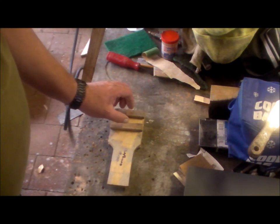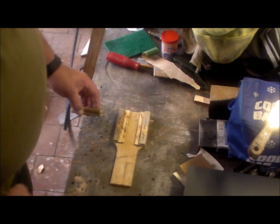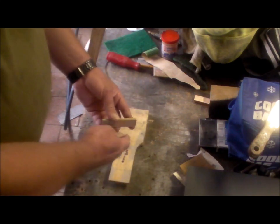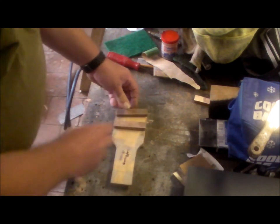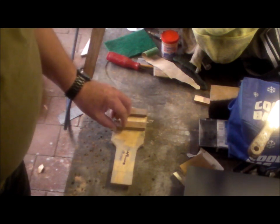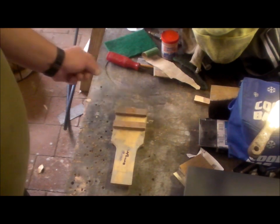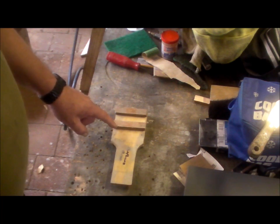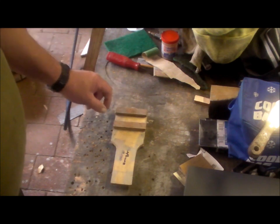These two are the cope side, so that gets laid up in the drag, clipped over. These are pinned, and they will fit into the receiving holes on that side, and then the cope is laid up. So yes, in the last clip I showed these were glued. They're not glued. They've still got to be 1 inch apart, but they're pinned. Okay. Don't make my mistake.